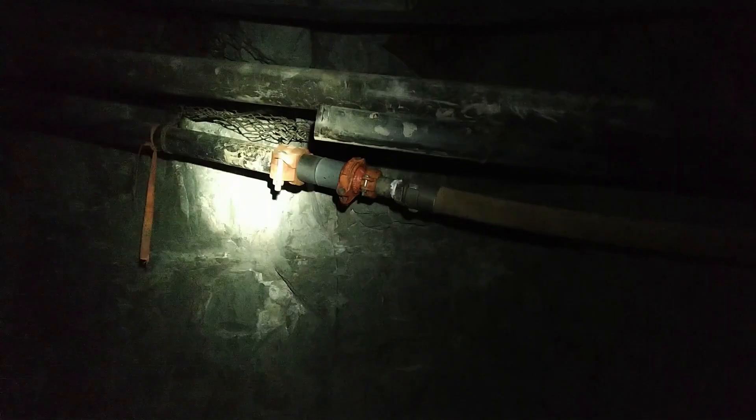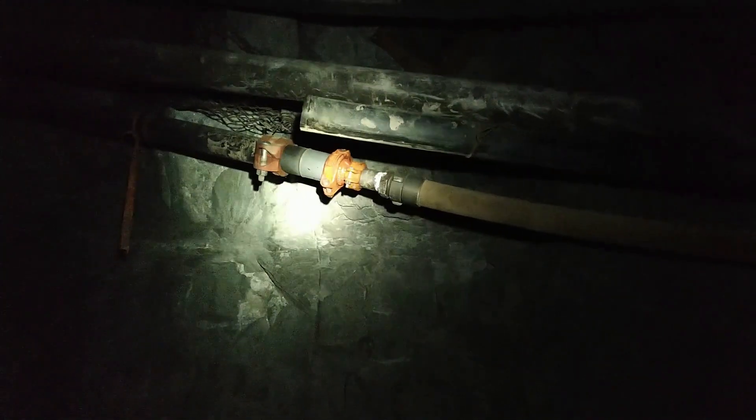Because that re-muck bay — we're pretty sure there's a fracture zone back in there that's holding a lot of water. You can see the back in there and the base is damp. Occasionally you'll see water droplets fall from the back down into the water behind that muck pile. What I think we're doing is draining that fractured zone — as soon as we pull water out of the decline, water from the fractured zone flows in. So essentially we're pumping down that fractured zone and that water course before we pump the deep one down.